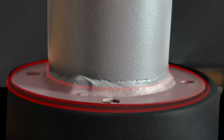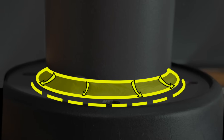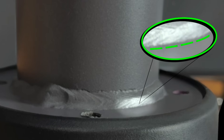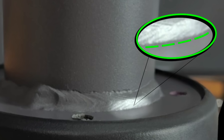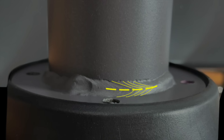This chunk of pipe is going to be very stubborn and tricky to heat up as much as the bottom flange will be. When welding something like this with a flange on the bottom, not only is this bottom plate going to heat up very quickly, but gravity is going to pull the filler material really low, especially if the welding parameters are not controlled properly with settings and technique. We can see the bottom edge is nice and smooth with a good blended edge. Up top, we have this hollow ridge where the filler material hasn't settled all the way up. Take a look at the puddle shape — the puddles are primarily sagging a little more to one side, which indicates the errors we're thinking about.